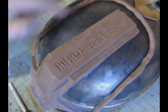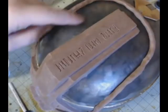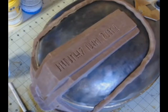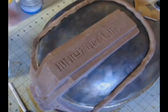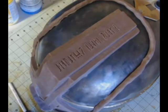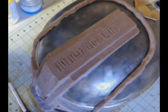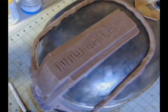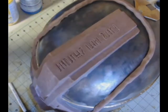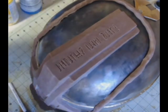Now here we're going to be filling in these open areas with the silicone. We're just going to mix it, and we're going to pour it in here. And that's where the concentration of the silicone is going to be. Now, is it all going to stay in that area? No, it is going to run outside of the boundary area. That boundary area is there primarily so that you know where to cut. After the silicone is dry, you'll know where to cut,